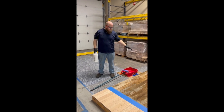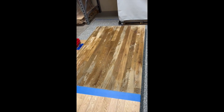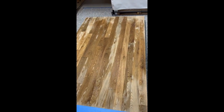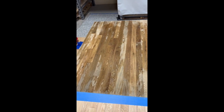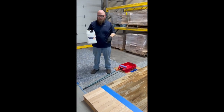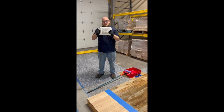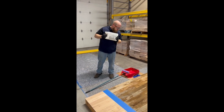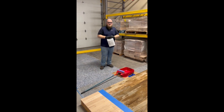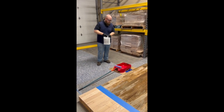We're getting ready for step two. This is kind of what we're looking for on the floor — there is going to be some gray faded from the brown. What we don't see is any shiny spots, which means the floor no longer has any standing surface puddles and we're ready to go. We're going to shake step two up really well. When we pour this out, you'll notice a visible difference from step one — it's going to be just a clear liquid.